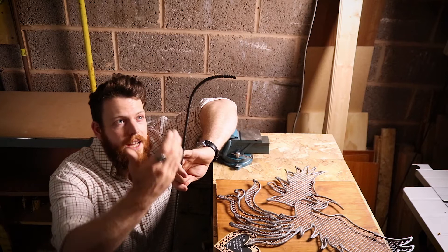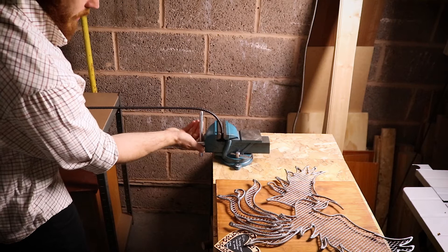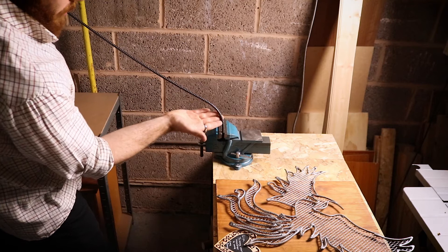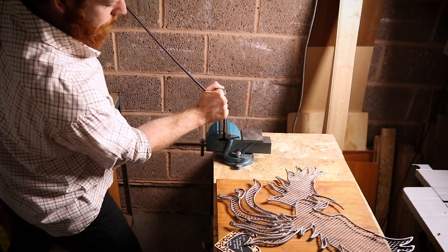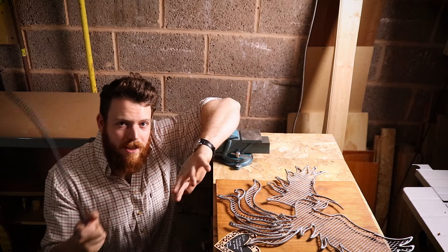You can actually decrease the radius if you've gone too far - it's not quite as easy but I'll show you that now. To decrease the radius it's a little bit different. I recommend getting the end in the vise and clamping it nice and tight, and then you're just going to bend it back the other way, putting pressure on the area that you're specifically trying to bend back. If you want the bend to start from a particular point, you can push from there and focus it just a little bit more. So that's how easy it is - really really simple, and you don't need any specialist jigs or formers. You can just bend freehand until you get the desired look.